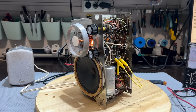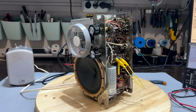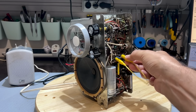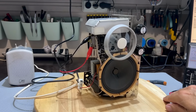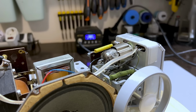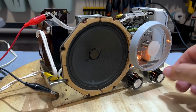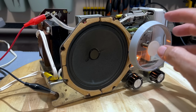Of course, the one thing you've always got to be careful with is this thing's got live voltages. So take care. Do not get zapped. It isn't fun. Then, of course, you can't forget to solder that shield back to ground over there and resolder the speaker wires. So we're good, ready for testing. Testing FM in the evening is difficult because all they've got is music, but they're all there.